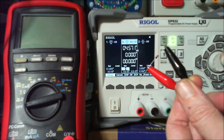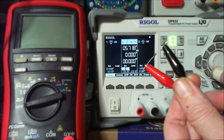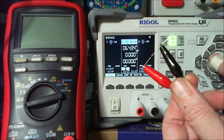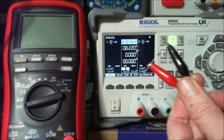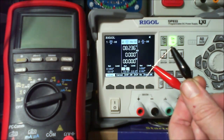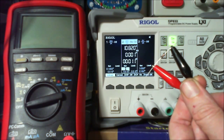And if I go back, did you notice? It just seemed like the amperage went to 1 milliamp there. I don't know what that is, I don't know if that's the power supply or. Okay. And what was this supposed to be? Oh, 12 volts, isn't it? I'm looking at the bag behind me now. 8.2. So on 10.